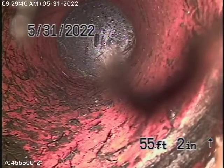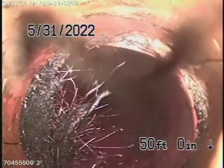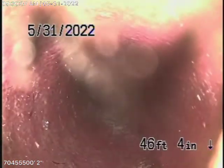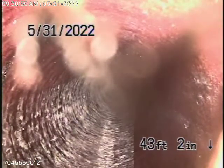Running the camera upstream now, we've come to where the pipe is exiting the house. This is all clay pipe over here. Coming back, there are roots at the couplings — you've got these birch trees here that are very aggressive. There are some roots in the pipe.